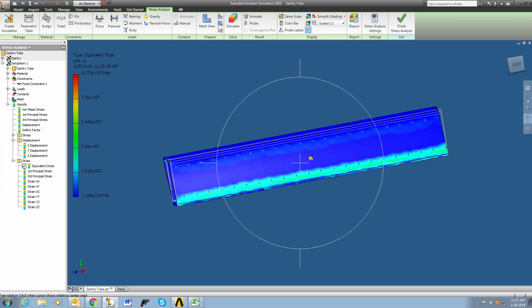So we put those two together. We don't really have a choice because these are machine tool grade CNC routers. But sometimes companies will actually, to cut costs, put a rack and pinion in there. Well, they're injecting play back into it. We just can't do that. Now, what makes all this actually function is a software we call finite element analysis. That tells us where the spacing on all these components go so that we get the maximum rigidity. And that's really why these edge finishers are so good on these machines.